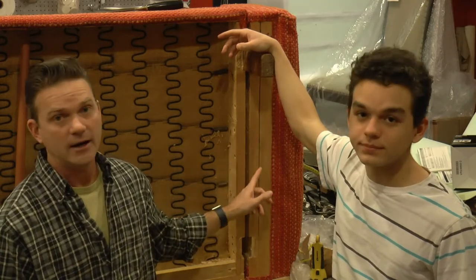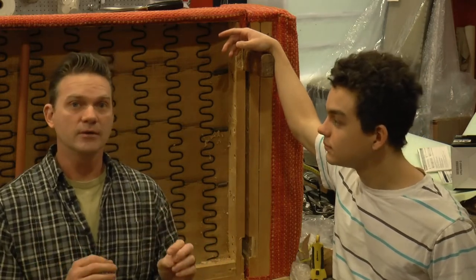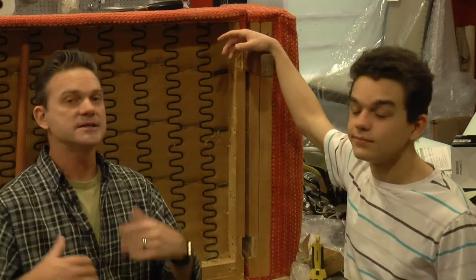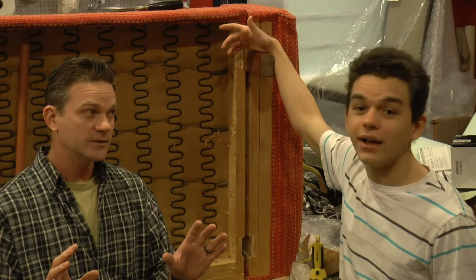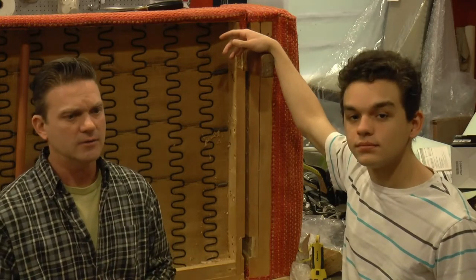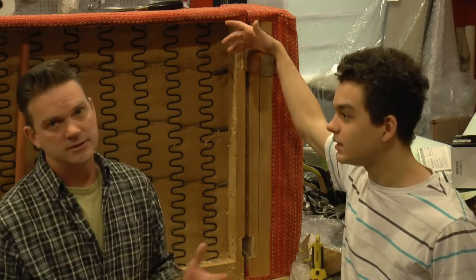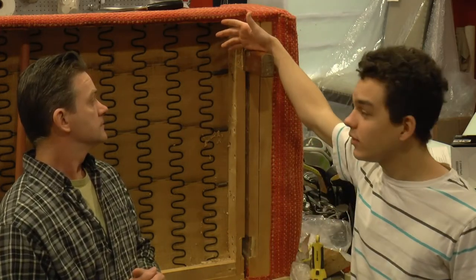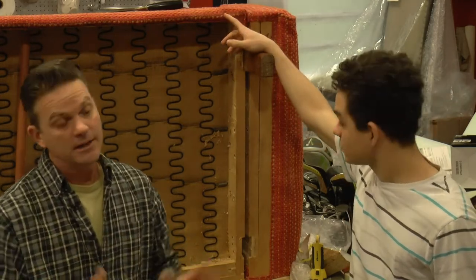We didn't want to cut through all the dowels. Whoever fixed this in the United States did a great job, but they fixed it so securely it actually damaged some of the original wood - it was almost as if it was never going to be reupholstered. We ended up with 20-something holes, 20 dowels, plus brads, plus a block - none of that was factory. The factory only had one bolt and one washer per leg.